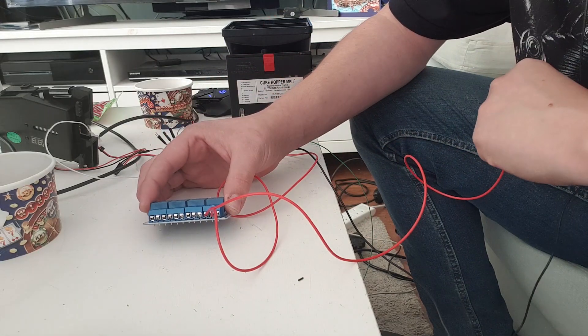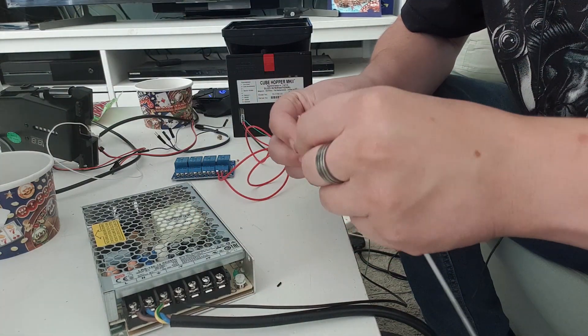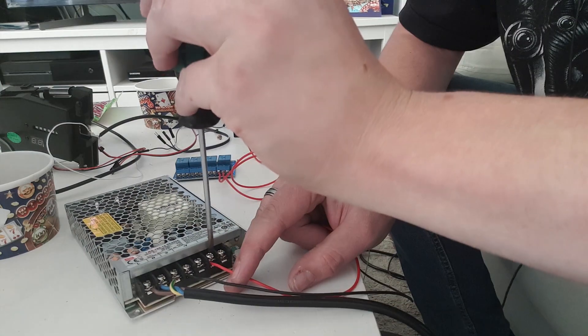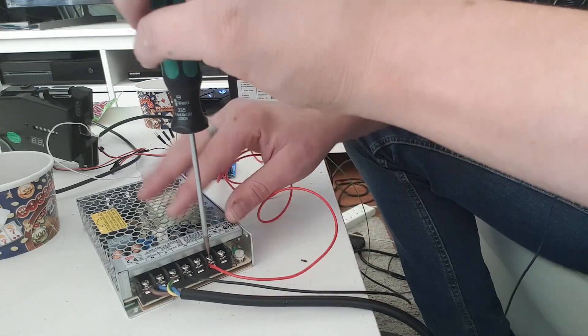I've also got another length of red wire — we're dealing with voltage — and this wire we're going to install from the relay to the power supply. Put one end into the pin on the relay and tighten up. Then take that red wire installed in screw one on the relay and install it on the plus voltage screw on the power supply. I like to keep these in situ together — using both plus and minus voltage pairs, keeping them matched. Unscrew that part of the power supply, hook it under the screw, and tighten. Make sure this is a very tight and secure fit.